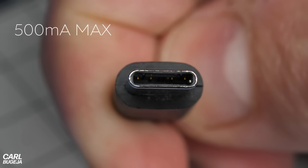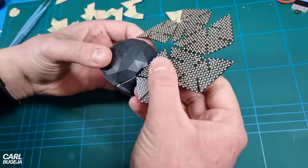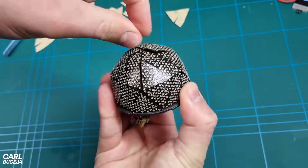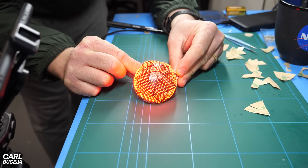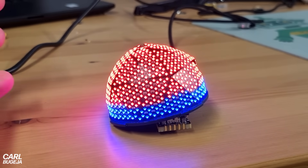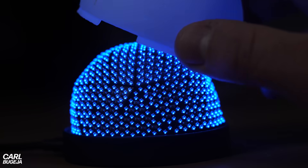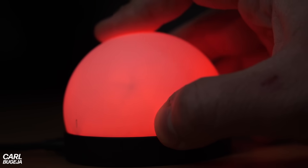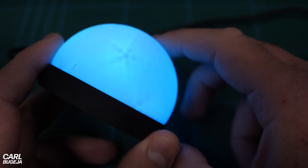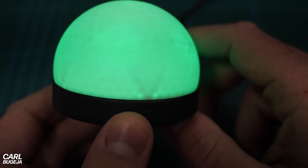The brightness was set to just 10% power so I could run it from the USB-C port. The next step was the scariest — peeling the tape cover, aligning it, and mounting it to the 3D-printed base. Some edges didn't stick too well, and the pixels were a little too bright to look at directly, but adding a white 3D-printed diffuser brought a nicer effect. Some seams are visible through the diffuser but there's no way to hide them further.